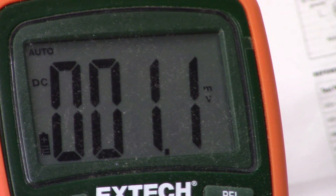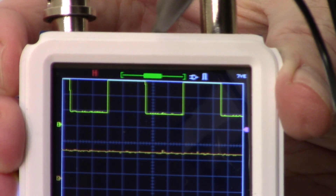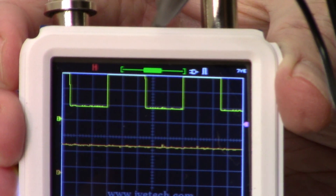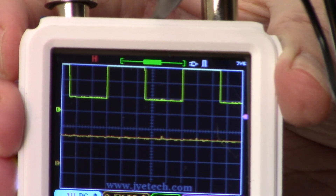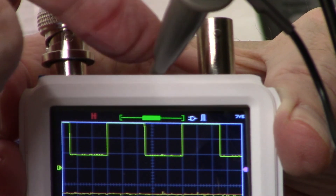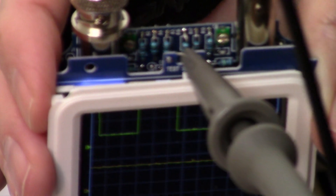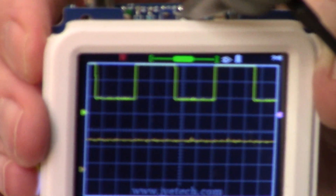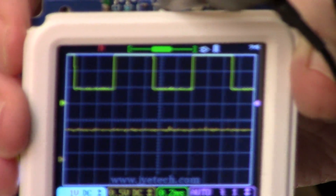That's the voltage verification — so far so good. I just did a little calibration and this is what the waveform looks like now. It's a bit tricky to calibrate with the trimmer capacitor because it's almost buried in the board, back inside here next to the BNC connector just before those resistors. But we're looking pretty good, and I'm going to go ahead and box this up and give it a run.